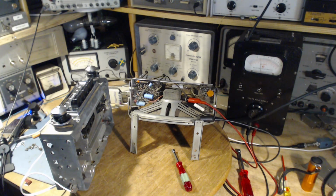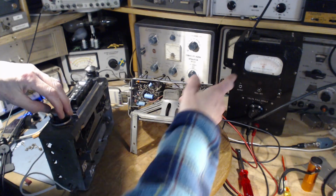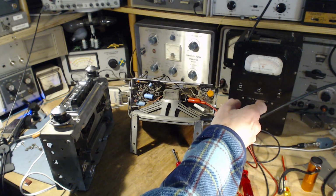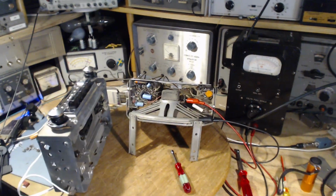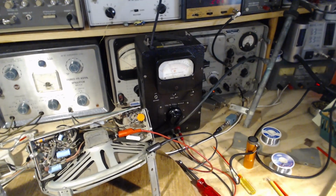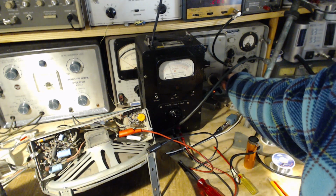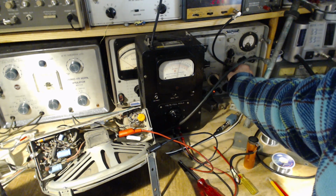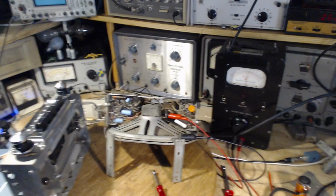Okay. Volume, so it's definitely the volume of the radio. Now, is it the signal generator, which is actually quite low? So I'm going to turn up the signal generator. We'll see what happens to this. Only you have to step to the left here. Yeah, that's too much. Goes down. Go up 10. Very clearly, that's the signal generator doing that. Good. We're ready now. Ready for the adjustment.